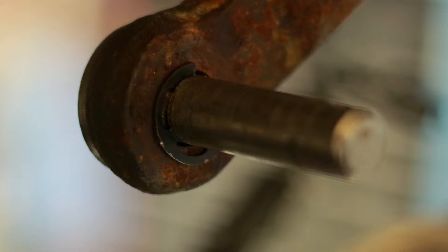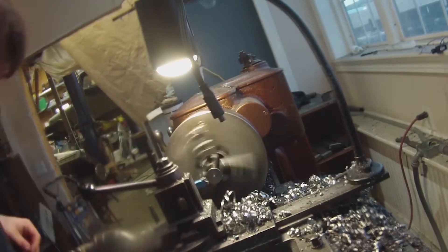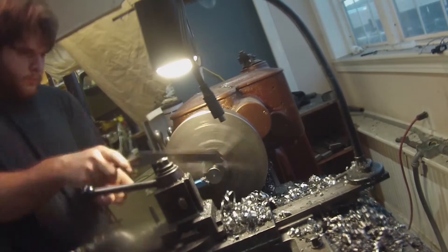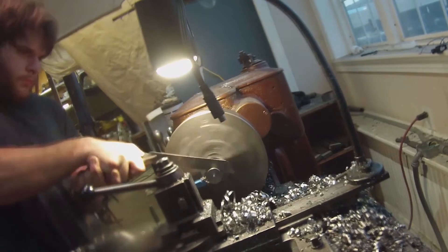I made the pin in much the same fashion and I was going to weld it to the sway bar. However, I suddenly realized that the sway bar is spring steel — I don't believe you can reliably weld to spring steel. To remedy the situation, I used a C-clip to keep the pin on. Luckily I was able to put the pin into my lathe and turn a groove. Unfortunately I didn't have anything to cut such a thin groove with, so I improvised. Yup, that's a sawzall blade. Don't try this at home — or well, anywhere.